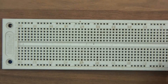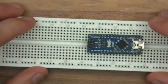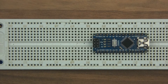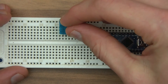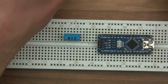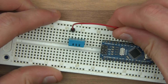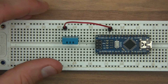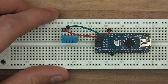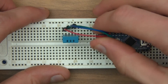Now it's time to wire up. I'll get a board and an Arduino. I always recommend that people use the nano, but if you're comfortable with another Arduino, that's cool. If you're a beginner, I'd say use a nano because it's easier. I'm going to push the sensor in — the four pins just sit nicely in the holes. The first pin goes to 5 volts on the Arduino. The next pin I'm going to use green goes to digital pin 2, because it's a digital device. Pin three is actually dead — it doesn't do anything. And pin four, you put the ground.